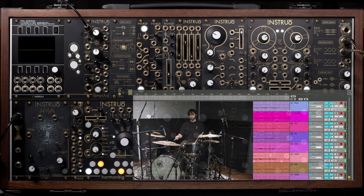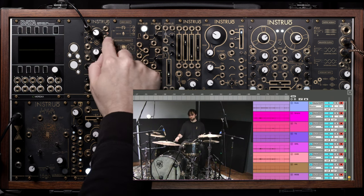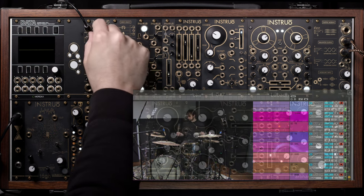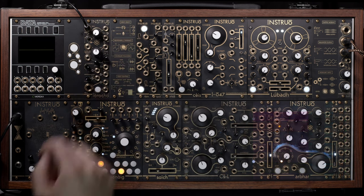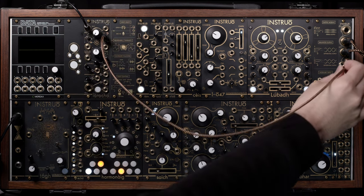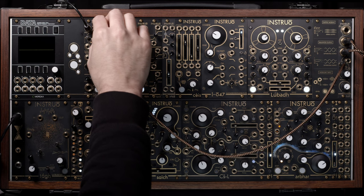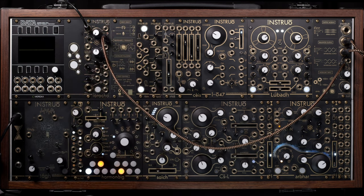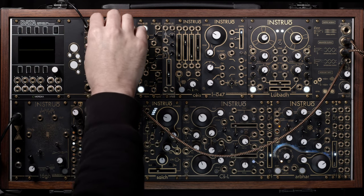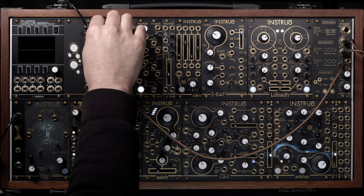I'm just running Ableton here, playing back some acoustic drum samples I recorded recently, coming straight from the headphone output jack. You can already see a LED indicator showing level. This thing has a pretty ridiculous level of gain — all the way down is roughly unity gain ratio, so if you put one volt in you get maybe 1.1 volts out. Calculation-wise, it's somewhere in the region of plus 40 dB of gain that you can get from driving this.